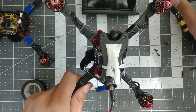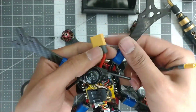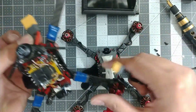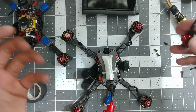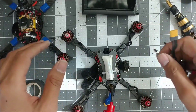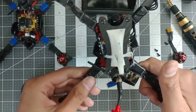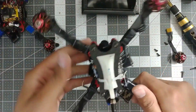For those wondering about weight — these plugs are not nearly as big as they look. Many people think they're a lot bigger because they're thinking of XT60s, but these are not anywhere close to the same size as an XT60. They're very small and very light. Your build will weigh an additional two grams after adding these plugs to all four motors. If two grams is going to bust your build, don't put these on — but if you can spare two grams, I think they're great. They haven't unplugged randomly except in crashes, and I haven't needed to spread the pins the way I do on an XT60.